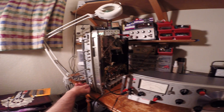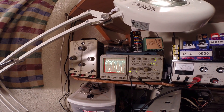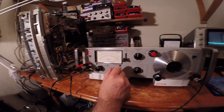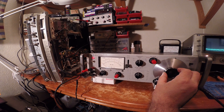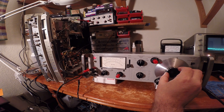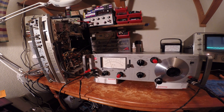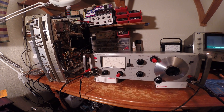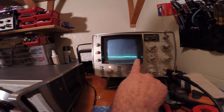Now we're going to take the power up to 25 watts. We're going to set the level on the distortion analyzer, set it for full scale, move it over to distortion, and null the fundamental frequency. You can see that we're getting up around 0.032%. That's a little bit higher, but it's still well within spec. And as we look over at the spectrum analyzer, we see no harmonics out here, which is very good.